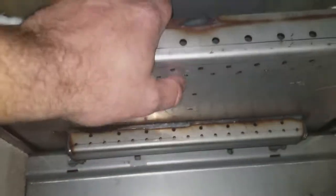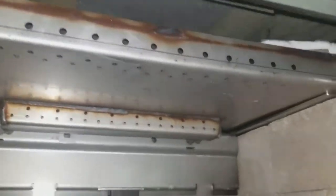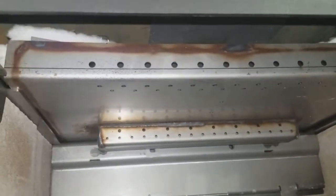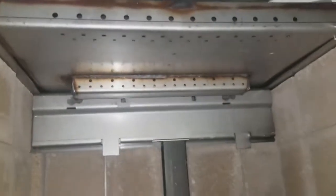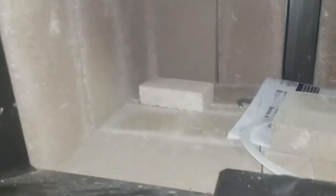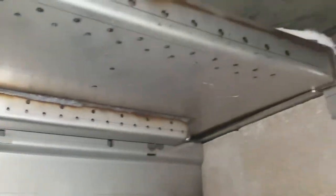Let's take a look inside. Up here on the top is the baffle — it's a very heavy stainless steel baffle. A lot of other companies use fiber or vermiculite baffles, but this stainless gives the feeling of being more sturdy than a fiber baffle. There's a pretty large interior — they say 18-inch maximum log length, but I'd bet at an angle you could fit considerably larger than that. You can also see the secondary air holes in there.